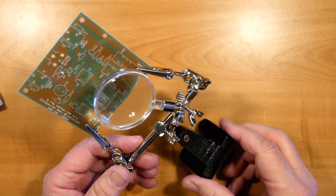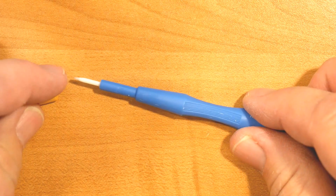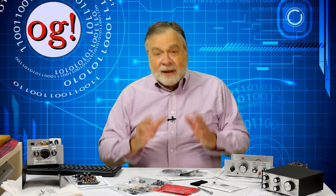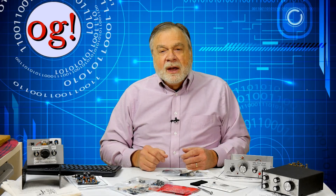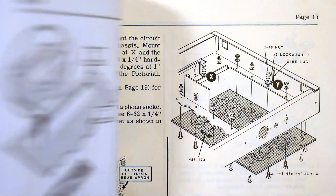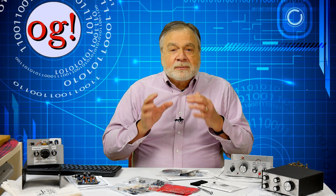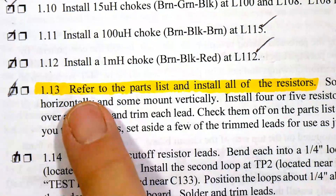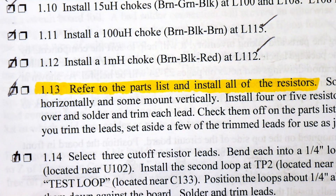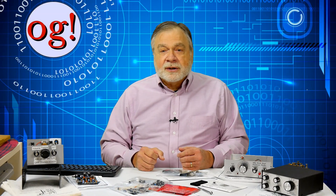You can supplement this with something to hold the circuit board in place. A nice item to have is a ceramic screwdriver for adjusting trimmer capacitors. I should point out that you may, and likely will, run into difficulties. Assembly manuals vary widely in quality. The gold standard is the Heathkit approach, which walked carefully through everything. However, sometimes manuals can be rather terse, such as this manual that simply says to install all the resistors. I've even found some manuals to omit critical steps.